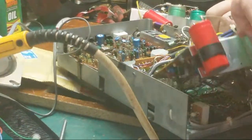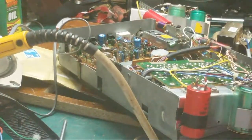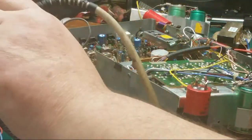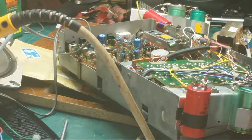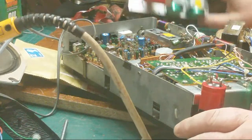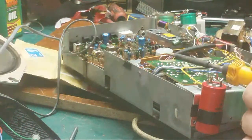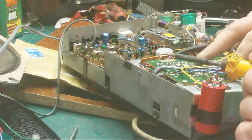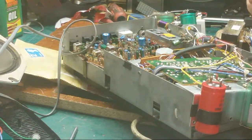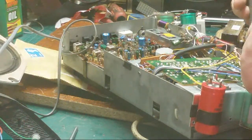So what I'm actually going to do, folks, because that transistor is worrying me, I'm worried because it's a regulator and there's a diode blown right near it. I mean, completely gone. Blown, not just open. It's gone, blown, annihilated, and that's what really worries me. I'm looking for other things while I'm doing that, like that possible dry joint there.